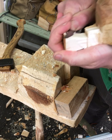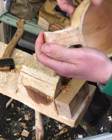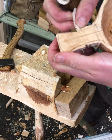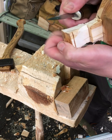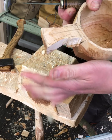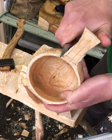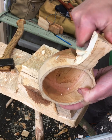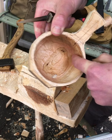Just push — you can pivot like this and push at the same time. It's very effective: lots of control, lots of safety, and lots of nice big bits of wood coming off. You can mimic it along here — obviously really close to the line already. That little mark I made at the start I'm not too worried about because I'm going to take all this top surface off anyway. I choke up and use it like a potato peeler right on the corner.